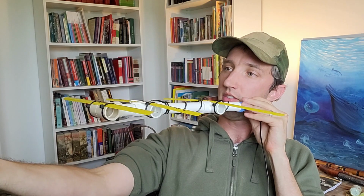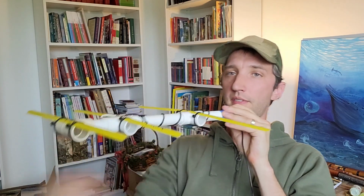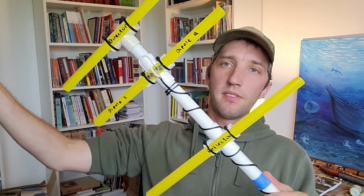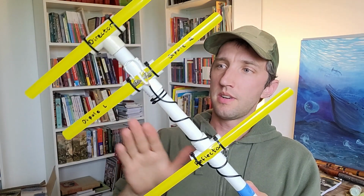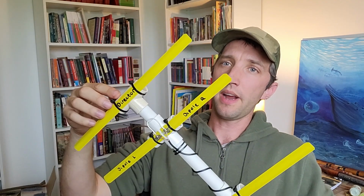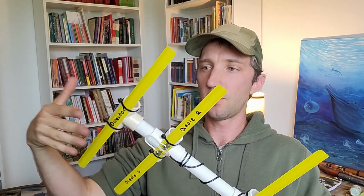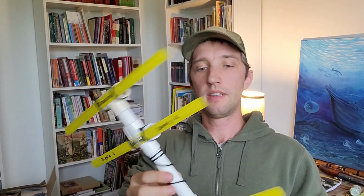And it has the most gain from the front lobe. Now, how it does this is the radio waves that are, let's say, coming in, reflect off this reflector into the driven element, into the main antenna here. And the director is called the parasitic element, so it kind of filters out anything that is not coming from the front as well.